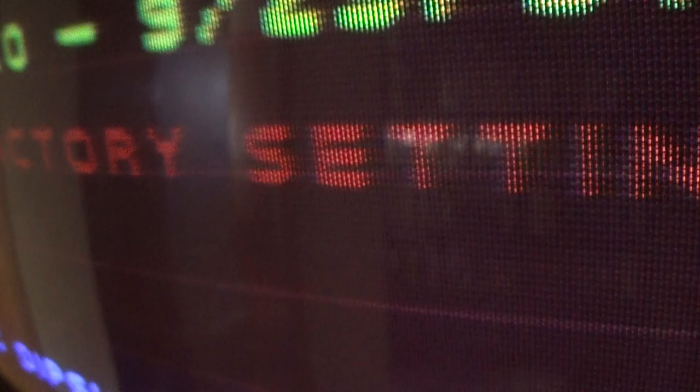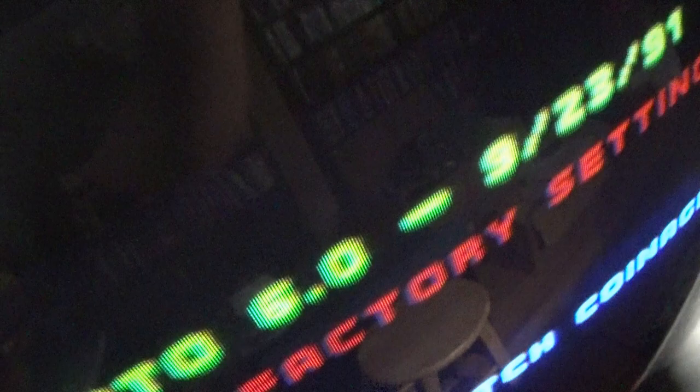All right, so we've tackled that hurdle. Let's do brightness all the way down, contrast all the way down, screen pot up until we get raster lines right there, then down till they just go away. There we go. Focus, and now we focus. We can see that we still have raster lines, so we'll turn it down till they go away right there. And now we'll do brightness and contrast. Brightness needs to be right there. Contrast. There we go. Too much. We're going to probably have to go right about there and then readjust our focus slightly.